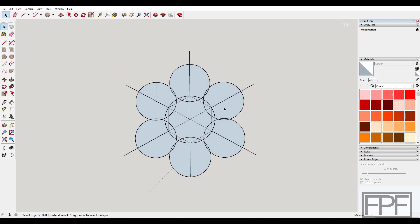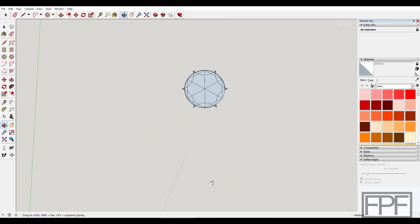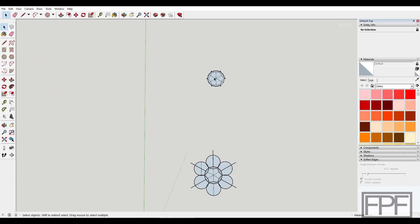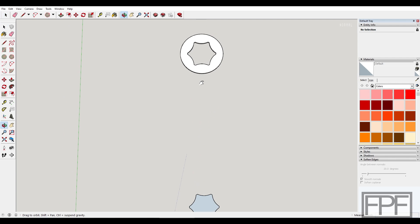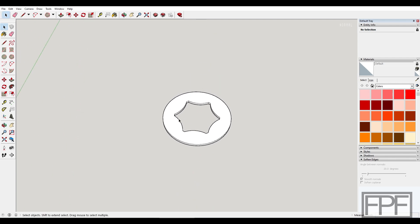Here is my design space for this. I have a single diameter here in the center, then I use the polygon tool to get six even points with lines projecting out, and then additional circles out here centered on those, figuring out the overlap to get close. You can see I go from that geometry to basically this shape — it's the exact same thing. Then getting rid of the geometry I don't need, it's starting to look pretty darn close to the head of that plastic nut. The final step is the inverse of that shape, thickened up so we can slip it over and see if it fits. I'm going to stop here and print this out to see if it fits before designing the rest of the wrench.